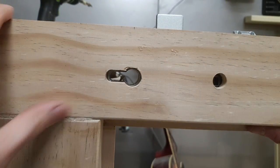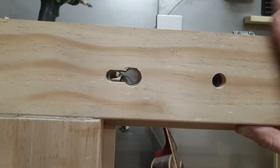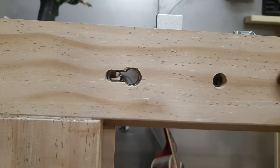Like I say, this technique works whether it's in the vise or hanging. Just use the face of the door as a flat surface to work your square from, and then you can measure the same both sides. It's quite often, if you've put a leading edge on your door to allow it to open, if there's a tight gap, obviously measuring from the edge of the corner of the door down to your latch is a bit inaccurate, so just putting that square across the face as a reference gives you something to work from both sides, and usually ends with a good result, or an accurate result, up to where the holes are going to go.